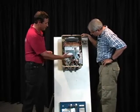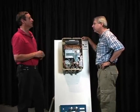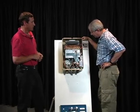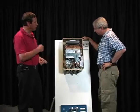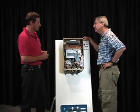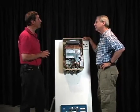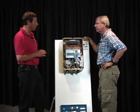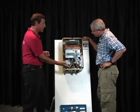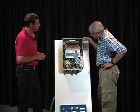And what's happening is these burners will modulate in 1 BTU increments from 15,000 to, in this case, 180,000 BTUs, always giving us the correct water temperature. So the scenario is when somebody comes in and turns on the hand sink in the kitchen to wash some dishes, then the flow rater detects that we may only have 1.5 gallons a minute of flow. A gallon and a half a minute of flow probably only requires 40,000 BTUs of burner to heat that water up fast enough to give us that output set point temperature of 120 degrees or whatever it is.